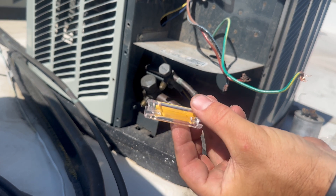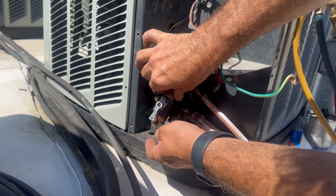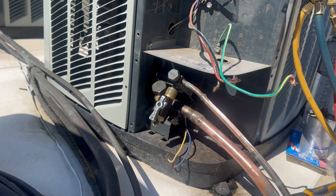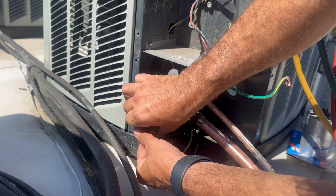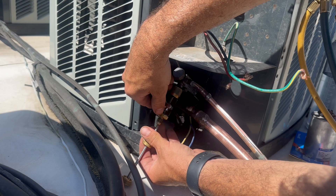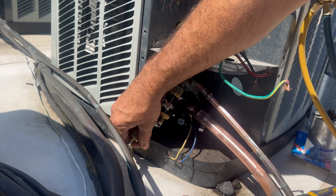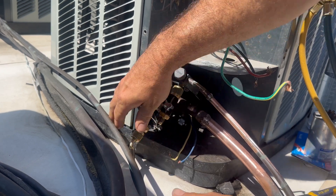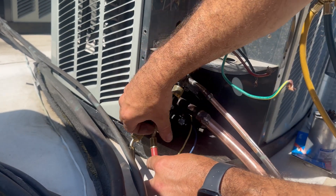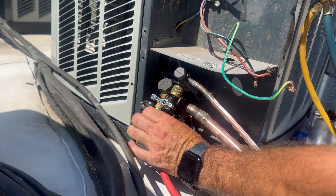This refrigerant I can label clean. I didn't have all my tools on me today, but I do have my valve core removal tools. I will be removing the valve cores from the suction line and the liquid line to speed up the recovery process. While I am using quarter-inch hoses for my manifold gauges, it's not optimal, but it will work and it will recover all of the refrigerant — it's probably what most apartment maintenance technicians are using or just have access to.